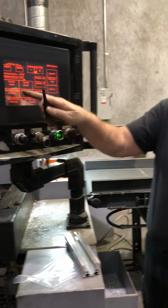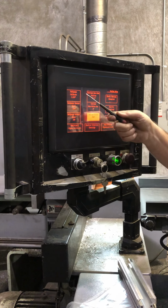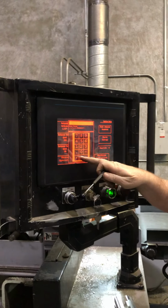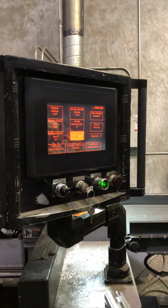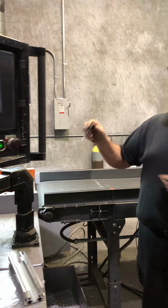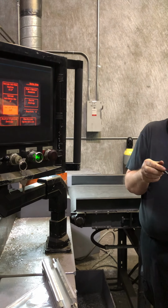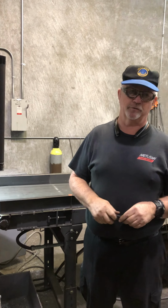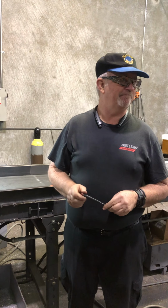But that is totally dependent on what you put in as your back gauge caliber. So if this is off, your 12 inches, your go-to, is going to be off. That's why I say the increment: the only thing that's going to affect the increment is the kerf. And the kerf's going to be close, so you're going to be within a couple of thou of what you're looking for. You can be a half inch off or more on a back gauge caliber cut, or on a go-to cut, because if you put the wrong number in there, yeah, you can screw it up.